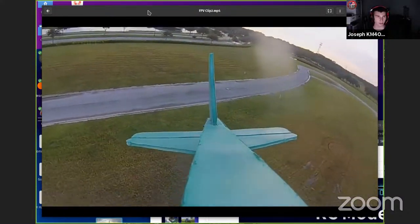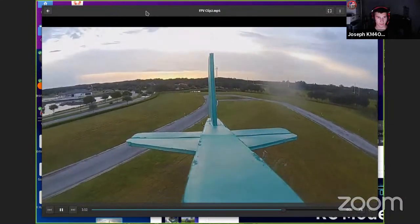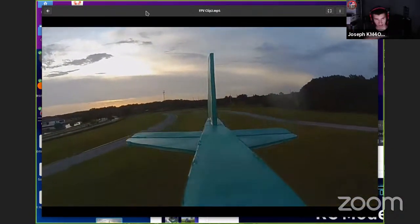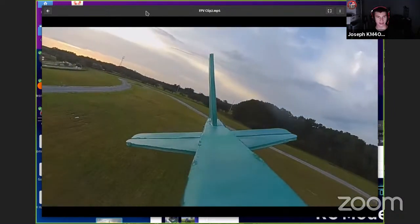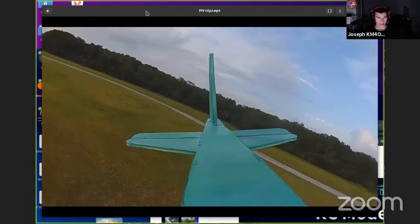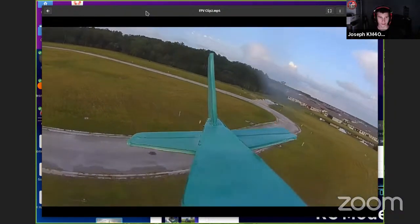These cameras are all rolling shutter. So if you've got a propeller in front of them, you're not going to see a blur. You're going to see lines going across it. And at certain speeds, like at certain RPMs on the motor, the lines will just freeze in place and can get kind of blocking your view.